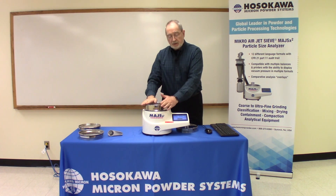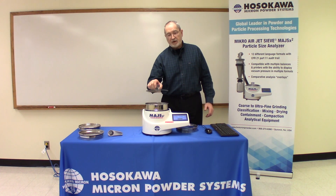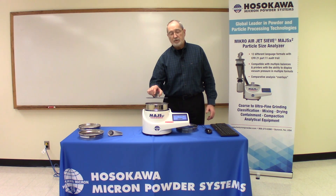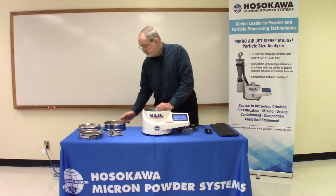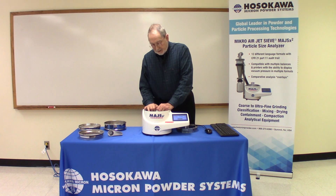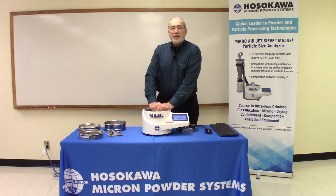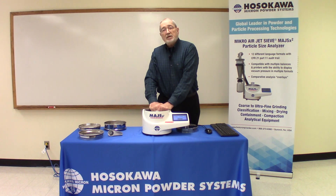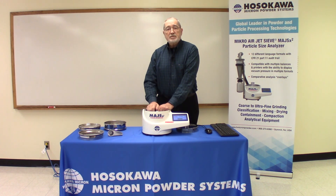When using an 8-inch screen, we also supply a different sieve cover, because you don't want the sieve cover to compress the material in the sieve screen. We have sieve screens ranging from 20 micron to 4750 micron, all of which are ASTM built to E11. We can also provide ISO standard screens.